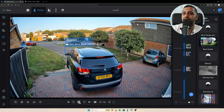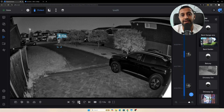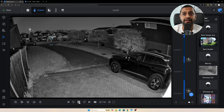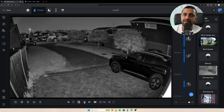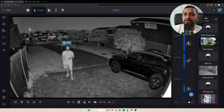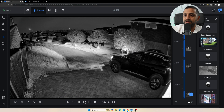For the nighttime testing, it's around half ten at night. In England the days are very long right now approaching the longest day. My driveway lights have just come on, so I'm waiting for them to turn off, with all other cameras' IR sensors switched off. I'm walking from the edge of the drive towards the camera. At about 10 to 12 meters it starts picking me up as a person, and as I come closer it recognizes my face — a green box appears around my face.